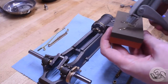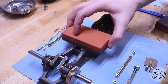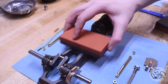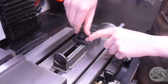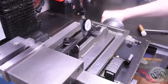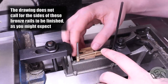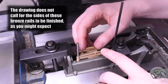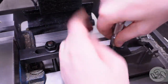Before the final fit-up I'm going to take my precision ground flat stone and just stone the tops of these rails a little bit. The finish on them was okay but I wasn't super happy with it, and this will ensure everything is smooth and coplanar. I'm also stoning the inside corners to make sure everything is deburred and finished up nice. Now I'm ready for the mounting holes for those rail guides. I'm setting it up in the mill with an indicator getting it nice and square, and doing this whole thing just with transfer punching - no fancy measuring. I'm lining it up with a gauge pin holding the assembly at one end and a transfer punch at the other, making sure the crosshead has nice even side clearance all the way down the travel. Then I transfer punch one end and deepen it with a center punch.